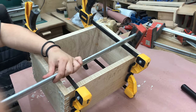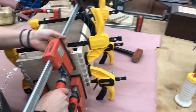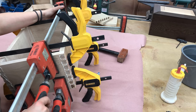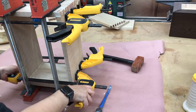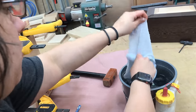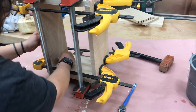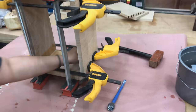I also like to make sure that I get glue on both sides of every joint — that way you get a very strong bond and you don't have any glue-starved areas. It is very important to clamp these joints together once you have glued them and assembled them. But you do want to take some care and don't over clamp. If you over clamp, you can cause the boards to bow inward towards one another, and that bow will still be there after the glue has dried and you remove the clamps. That will be very obvious on the box and very hard to deal with when it comes to creating the lid and everything else.